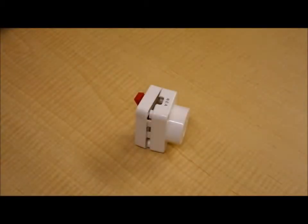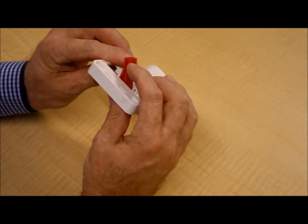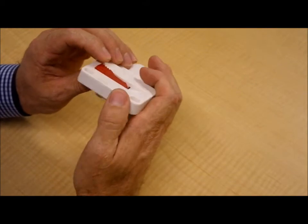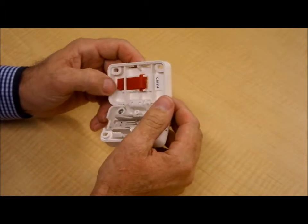Some do's and don'ts of terminating a connected switchgear patented SMS1QF plug base. A couple of things to remember when you're wiring this particular product. When you're rotating the rear lever into the locked position, once the housing has been closed, it needs to clip. If it doesn't clip, then you won't terminate the product successfully.